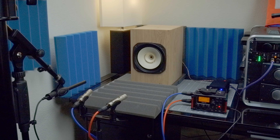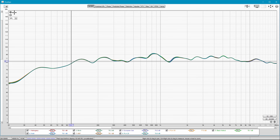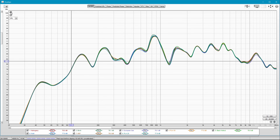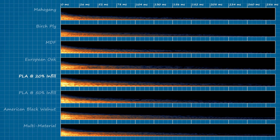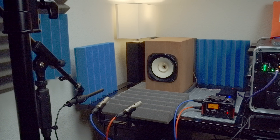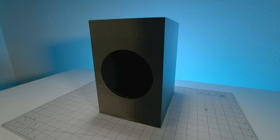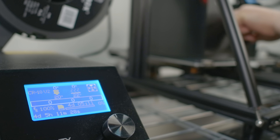One after another, the enclosures are tested with a wideband frequency sweep, and when we overlay the response graphs, they appear nearly identical. It's not until we expand the y-axis that some minor deviations come to light, but they are just that — minor. The biggest difference between these materials comes down to their harmonic properties, and when we overlay the distortion results, a few things become apparent. Right away, the enclosure printed at 20% infill is the clear outlier. The spectral maps confirm this, and so do my listening tests. Importantly, it is also the only outlier, even in terms of weight, suggesting that with enough mass, thermoplastic can be a viable enclosure material — at least for the patient enthusiast.